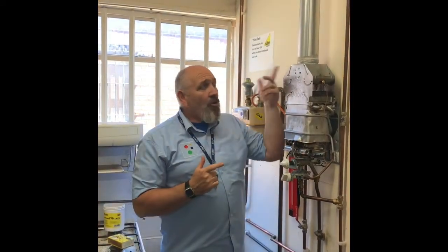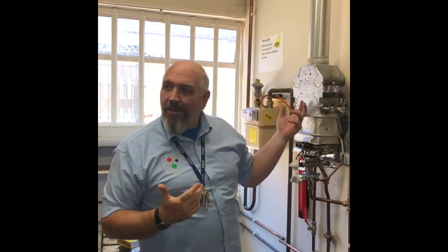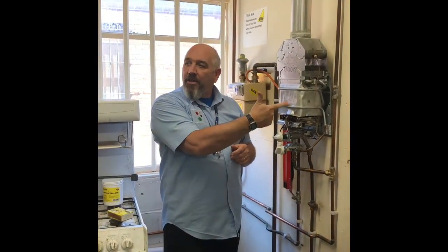So you've done your visual inspection; you're ready to go. The test is that the flue will still work with just the ventilation for the gas — because nobody runs their fires with their windows open. You're totally relying on your flue. Heating systems are used in winter, not summer, so all the doors and windows get closed. That's called putting it under maximum stress, or putting it in the worst-case scenario — all you're relying on is the ventilation from the room.